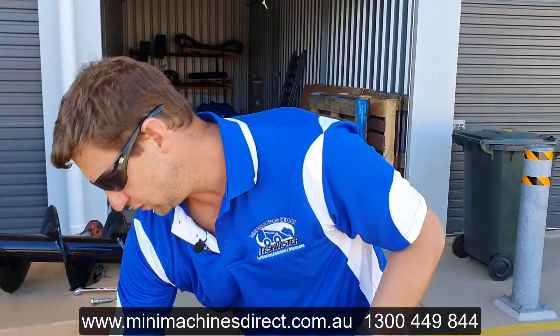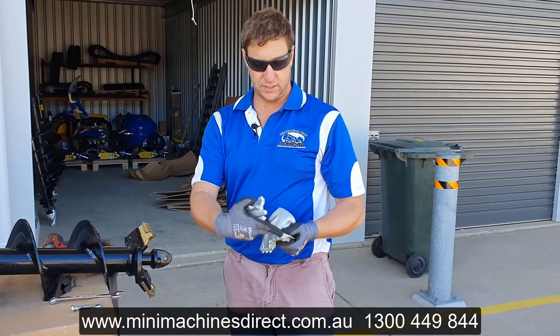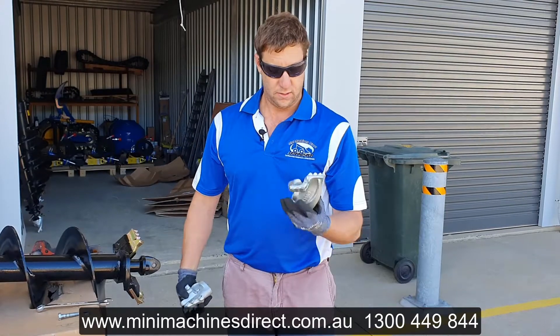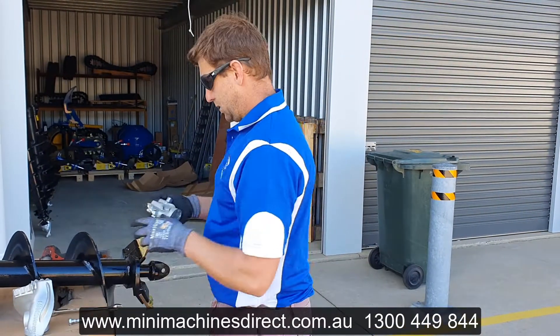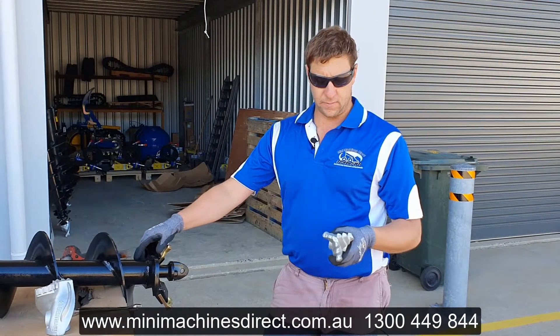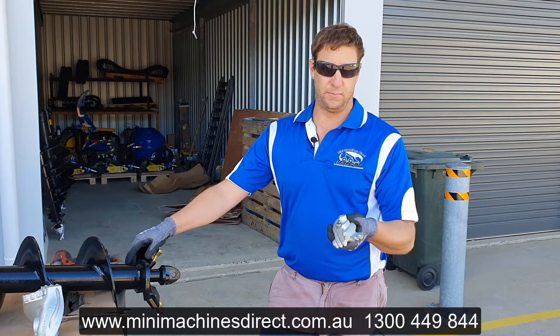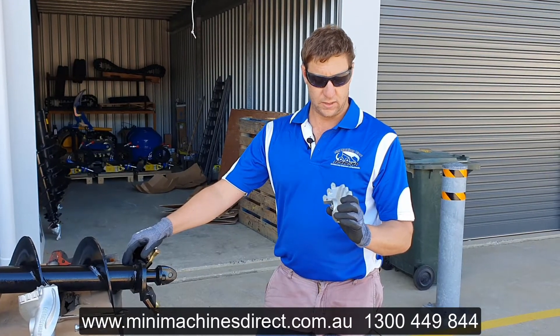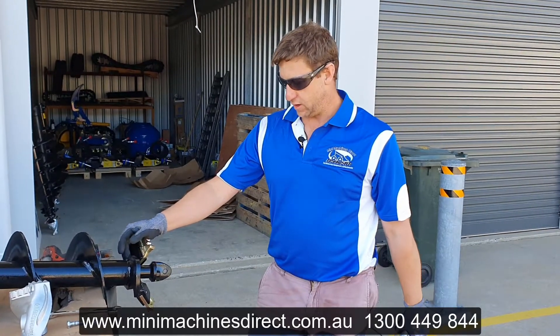In terms of pilots, you've got the standard tungsten pilot here — it's the most common, with all the tungsten wear pieces on it. A very efficient, hard-wearing tip. Or if you're in really hard, rocky ground, you might be better off with the extra dig pilot, which is good if you've got really rocky, fracturable rock.